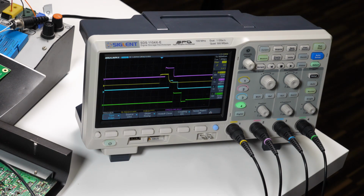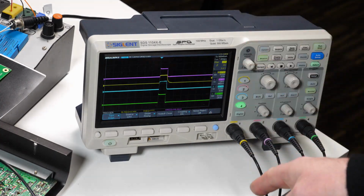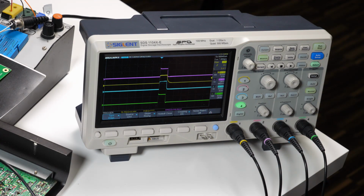The reason for that is MIDI is a serial protocol. MIDI note-ons take 1 millisecond roughly to send, unless there's running status involved. Running status makes it slightly quicker, only takes 2/3 of a millisecond to send. But basically, if you're trying to send 4 triggers at the same time, it's going to take you at least 3 milliseconds for those triggers to go out, and they're not going to happen all at the same time. That's the reason why the internal sequencer, every trigger sounds exactly the same.